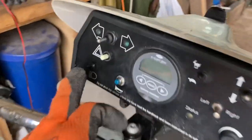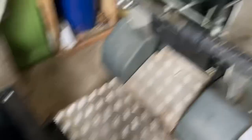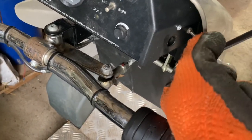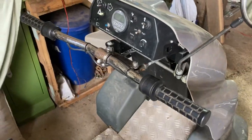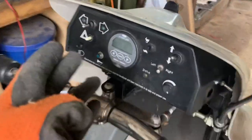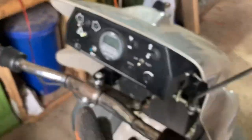All of the light switchboard and switches weren't there either. I've been really busy re-soldering all of these switches on the underside and trying to work out exactly how this thing works. It turned out on the potentiometer, the kids who tried to vandalize it had stuck a screwdriver in and crossed two of the pins. We just pulled those pins apart and lo and behold she fired up. I had to sort out all the broken wiring where kids had obviously tried to hot-wire it, ripping off the board and snapping off all these switches.